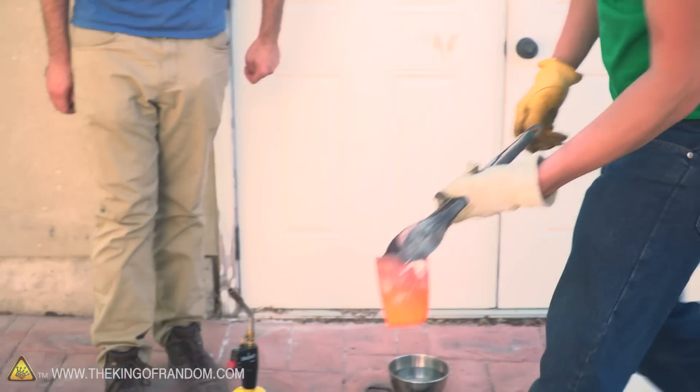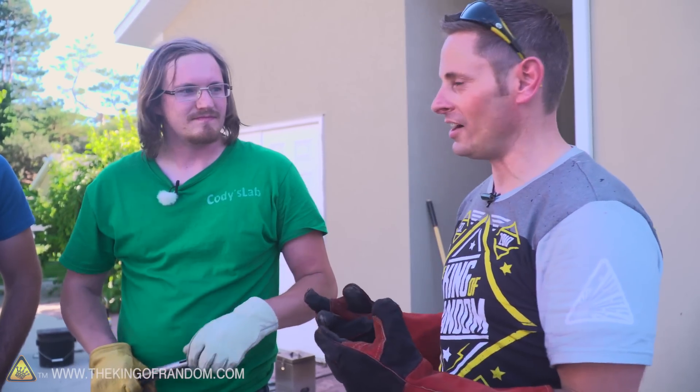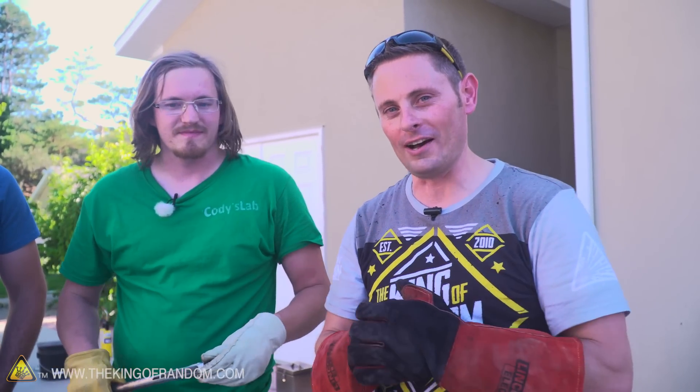I also got the other bit of glass — the leaded glass. I ended up pouring that out onto a plate along with some lead because it had reacted with the crucible and formed metallic lead. We poured it out on a steel plate, mashed it down, and transferred it to the container as well. While the glass is cooling, we're sticking it into a bucket full of vermiculite, which will help it cool at a slower rate and prevent cracking. Ideally you'd want to anneal this glass so it doesn't crack in the future, but for this video we just wanted to show proof of concept.